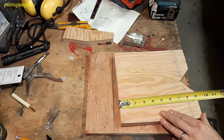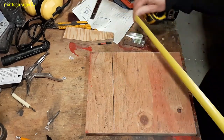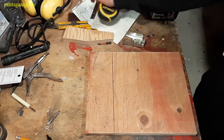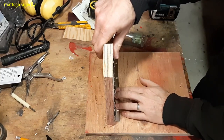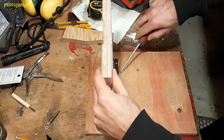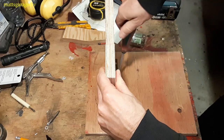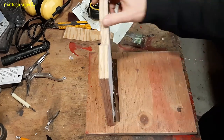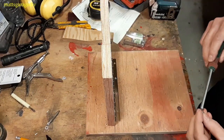My rest is gonna be nine inches tall. So on my base, I've marked off nine inches and squared that line straight across. That is going to be where I want my hinge, or the edge of my board to be — right like this. I'll screw that in place. So it hinges like that. I'll add a couple more screws in here real quick.